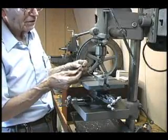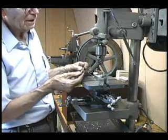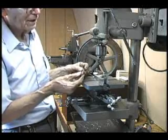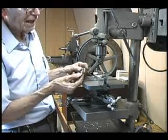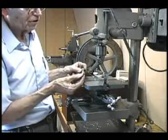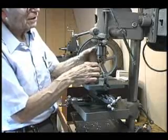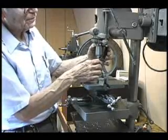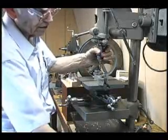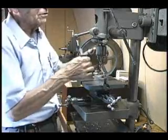The type of mill I can use is a single-ended end mill. The one I have here is a four-flute type. It's 5/16ths of an inch in diameter, which is the diameter of the cutting portion. The shank is actually 3/8ths of an inch, which is well within the limits for this chuck. I put it into the chuck securely. There's a lot of lateral pressure when you're doing milling, so you want to be sure that it's good and snug.